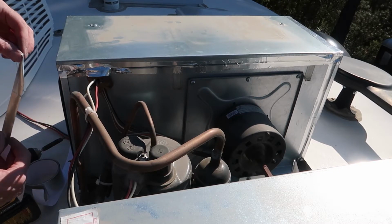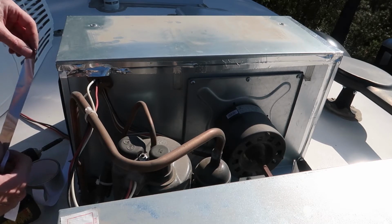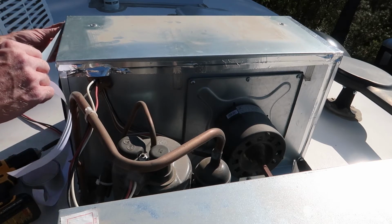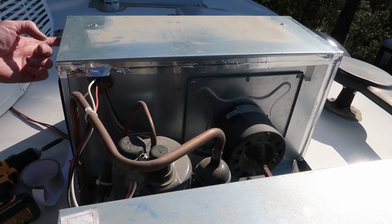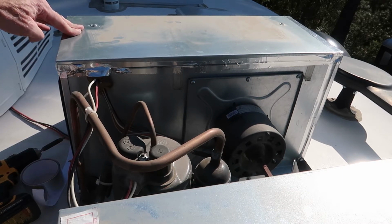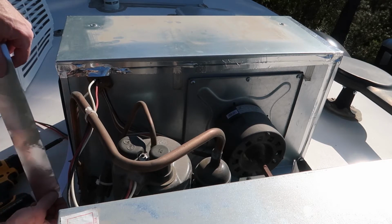Another one is sealing up your ducted AC where the ductwork attaches to the ceiling. You can pull the little round vents out of your ceiling, and the ductwork may kind of be floating in the ceiling. It may not have a good tight seal to the actual ceiling panels. So that's what that particular video shows.